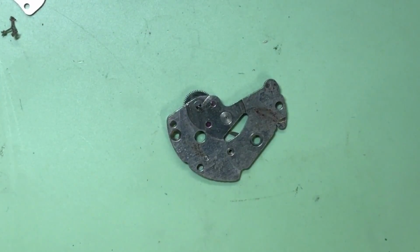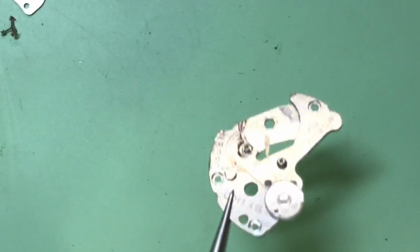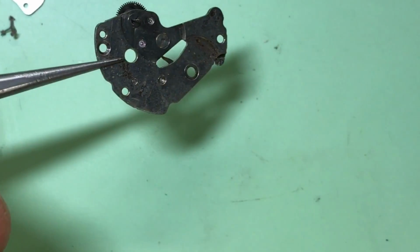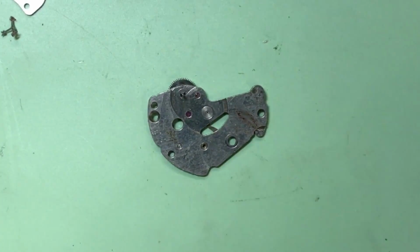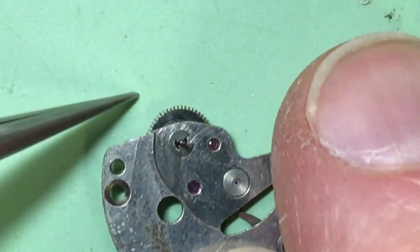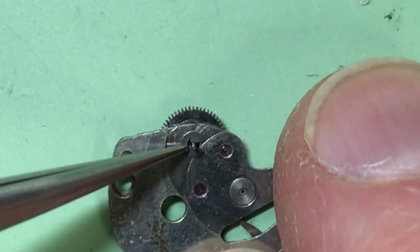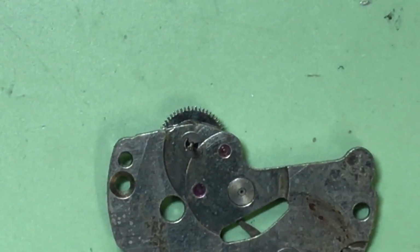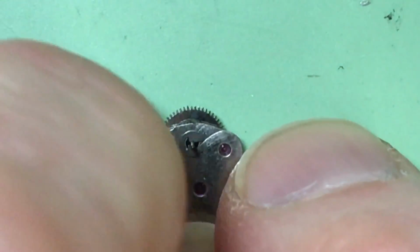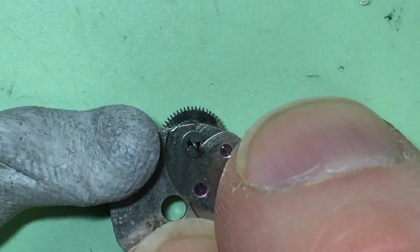So the last thing to show you, if you want to do this properly, is the transmission wheel here for the pull lever. So if you want to clean everything and oil everything properly, you need to remove it. And it has, oops, my camera's on the move. You can just see it there on maximum zoom. Has like a circlip, and these things can be horrible. I don't like circlips, but I'll just put a little bit of what looks like quite dirty Rodico.